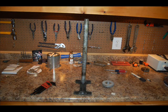In this picture we are looking at what turned out to be about two hours of work on the lathe—the declination shaft. As you can see it is pretty dirty, with deformations where the shaft collars and the weight had been tightened too tight into it. It is sitting on the equatorial saddle, which has been pressed on, so I cannot take this apart any further. I will also be cleaning up and repainting the saddle; it is painted with wrinkle or hammered effect paint, and I may sandblast it before repainting.